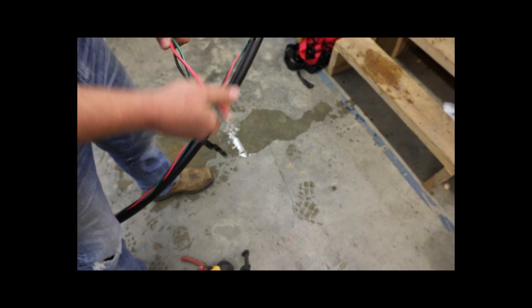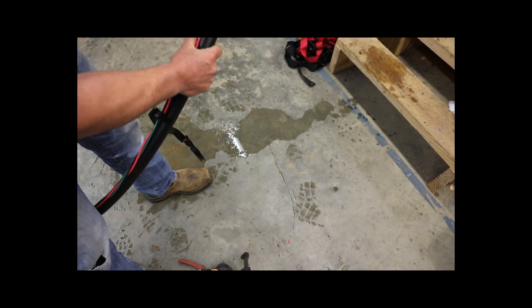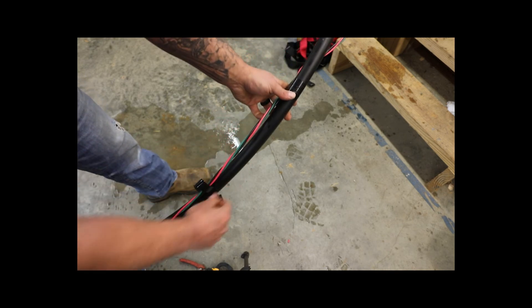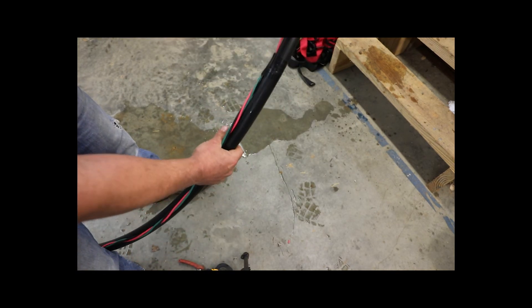I'll show you on this wire. Just because your wire's not broke doesn't mean your wire's not crap. You need to check it and make sure it's not skinned with bare wire showing. Within about the first 20 feet of the pump — sometimes it can be higher than that — that's where issues tend to occur.